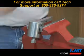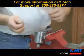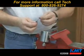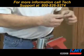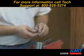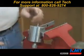We can take our new stem and our backup ring with the groove in it. It goes down, and our brass backup ring with the step in it goes towards the seal. Use a little bit of grease on the stem. Position it in the hole of the seal. Press it in.